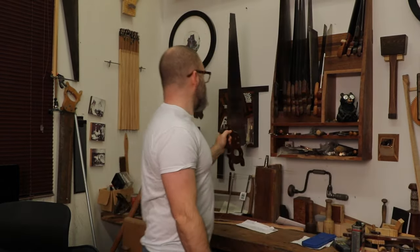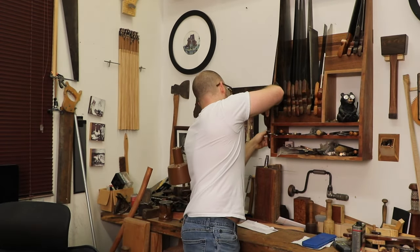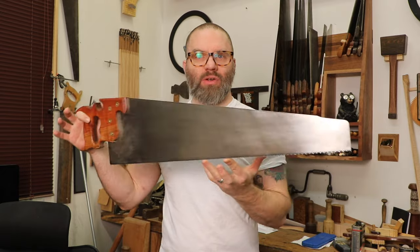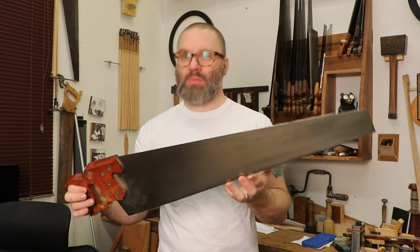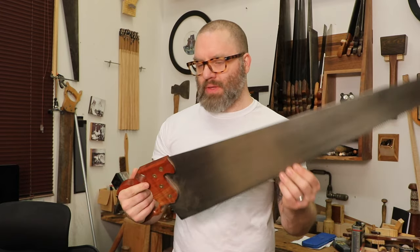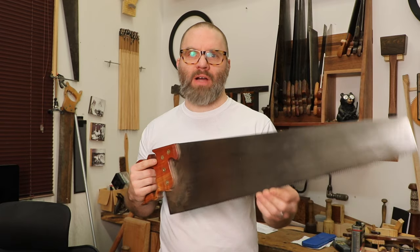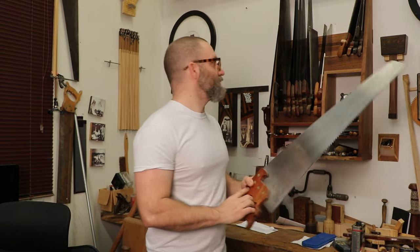I'll hold it back here, or cut vertical. So I use that one quite regularly, as well as the saw that I believe you just saw in the video, which is a straight rip saw. It has a thinner kerf blade. It's a little smaller than that other one, but it's a lot less aggressive. So this one I was able to get less than a 16th of an inch of a kerf through the whole board you just saw. So that way I'm not using an 1/8 of an inch on a table saw. Okay,